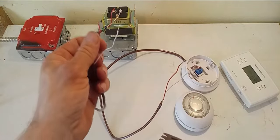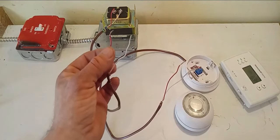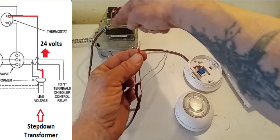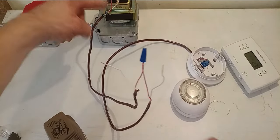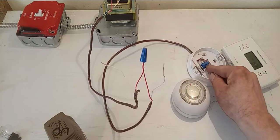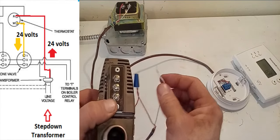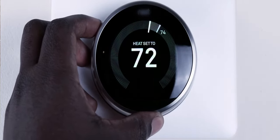We could send power directly from the transformer to the zone valve, but we don't want to do that because we want to be able to turn this valve on and off. So the power from our transformer is going to go from the load terminal on this red wire straight up to the thermostat. This red wire from the thermostat goes to our R terminal. When we connect these two wires together, we send power from the transformer through this connection right up to the R terminal on our thermostat. So now we have 24 volts from our load terminal going through this connection and up to our R terminal on our thermostat. When the thermostat calls for heat, it closes the connection internally between R and W, sending 24 volts on the white wire from the W terminal back down. So our 24 volts coming back from the thermostat goes right to our number one terminal on our zone valve — this is how we use the thermostat as the on/off switch.